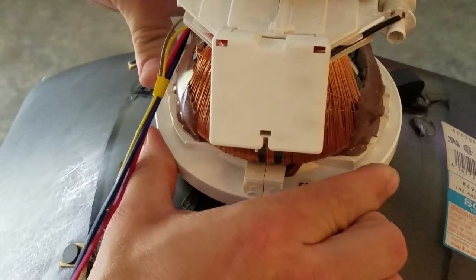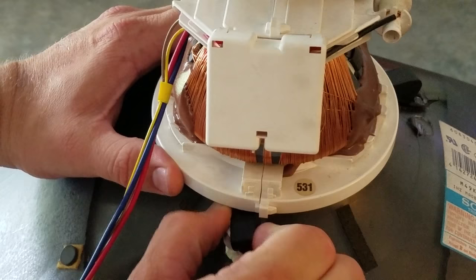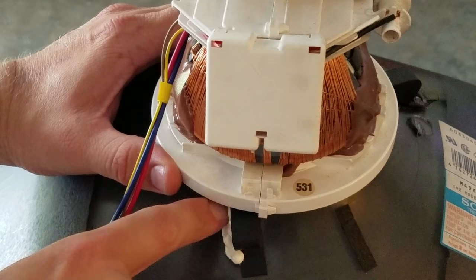So what we're going to do is move our yoke on the test TV back to where our screen is level, and then we're going to make sure that these points are nice and tight and put some fresh epoxy over this, touching both the ring and the pad, so that it will stay in one spot for the future so we won't have to make another yoke adjustment like this.